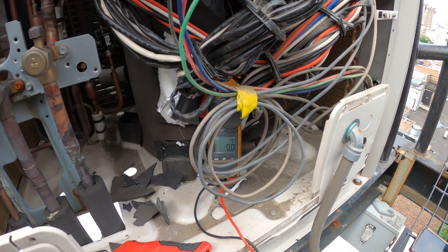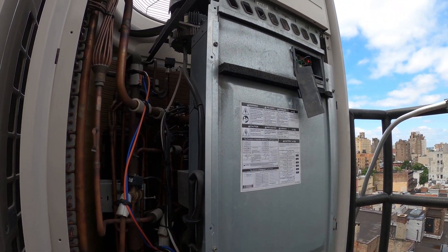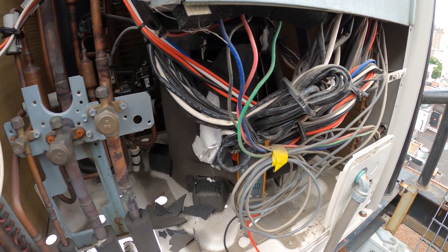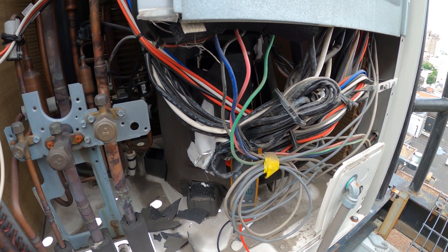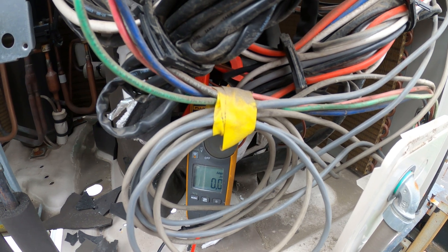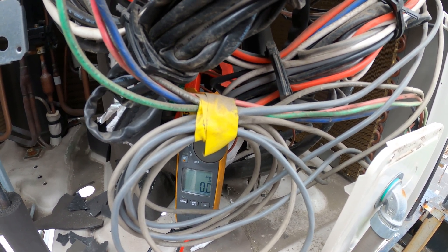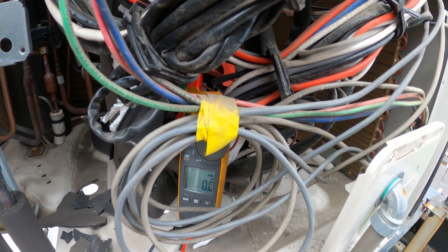At this point, you'd want to check the main board, make sure the power board is doing its thing, check the converter and inverter board, and run an insulation resistance test on the compressor. But clearly, as you can see with that amp draw, what's happening is this compressor failed mechanically — something inside broke and the internal components are locked up. We could do an insulation resistance test to see if it also failed electrically.